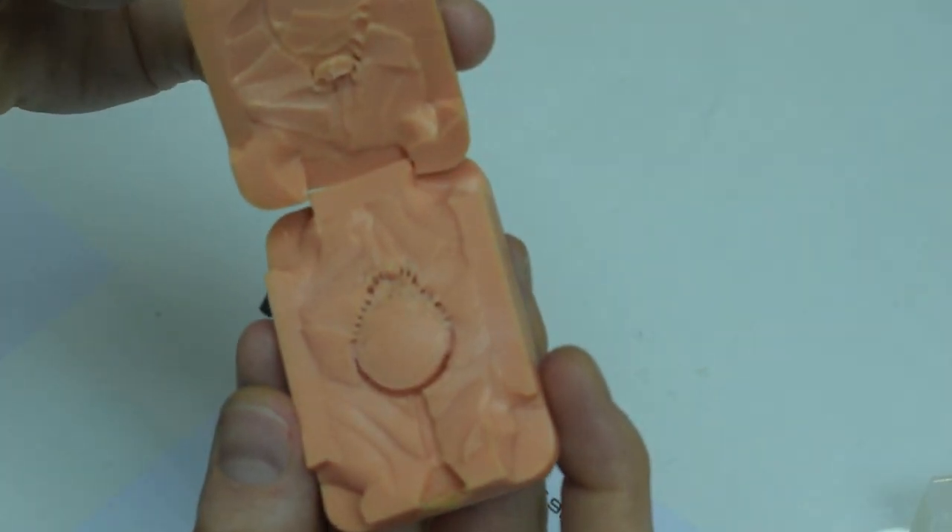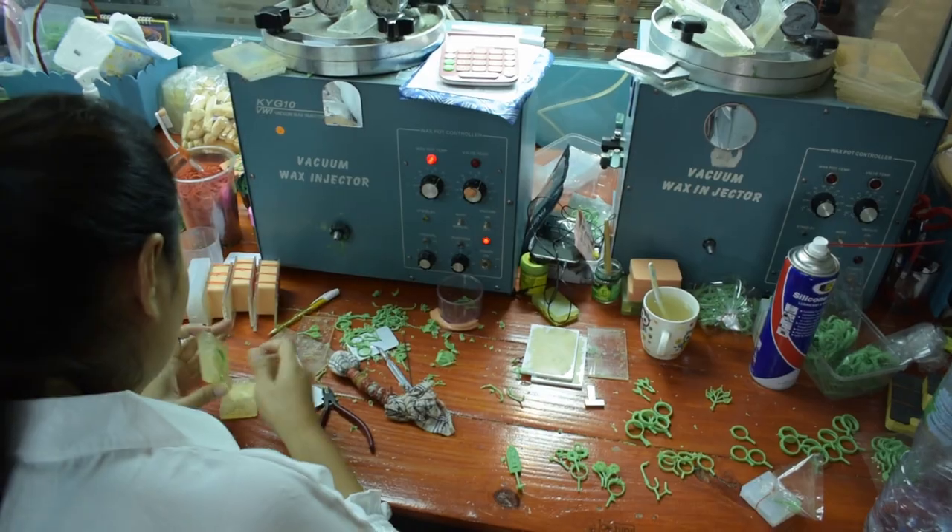So now we have this one, but we need to make the mold before we can make the double. If you want to have more than one, the easiest way to do that — and you can make as many as you possibly want — is by making a silicone mold. They basically just take rubber and squish it together in a sandwich with your now cast ring right in the middle. They can take that silicone mold and inject it with wax and make as many wax models as they want — hundreds, even thousands of these custom designs once you have the mold. I would just take this as it is to the people that make the mold, because if you go through and file everything, it gets smaller and they lose some detail. Better to leave it as it is — they have more room to work with when you go to finish the next rings in the future.